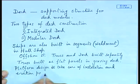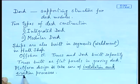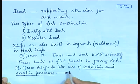This is very important in offshore structure design, because part of the installation will take place in the water. The installation on land, like ships, most of the ship is actually built in your slipway or the graving dock. You are out of water, but here, as I told you, for large or tall offshore structures, part of the structure is lowered onto the seabed and then it is positioned and then welded. More difficult task. So, this installation and erection process is of paramount importance for offshore structures, and these are also related to the structural stresses coming to the platform.